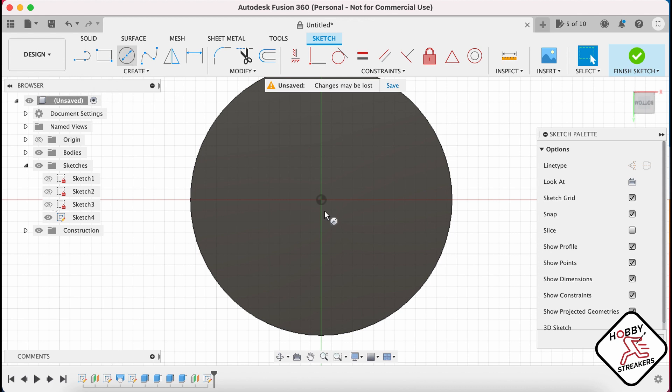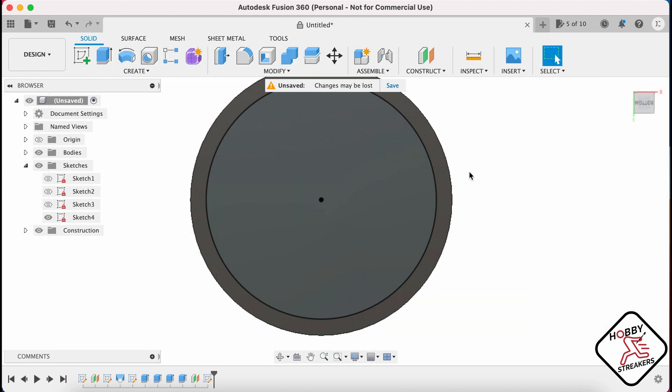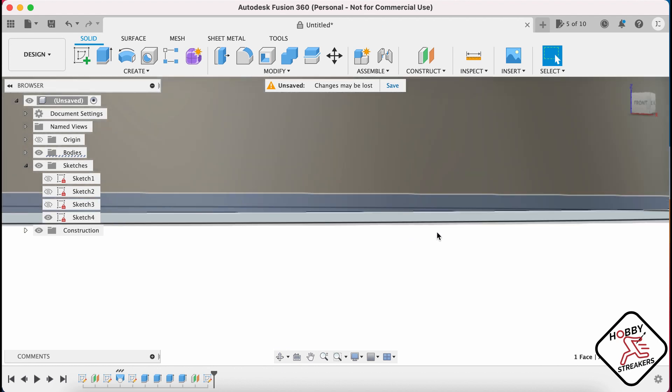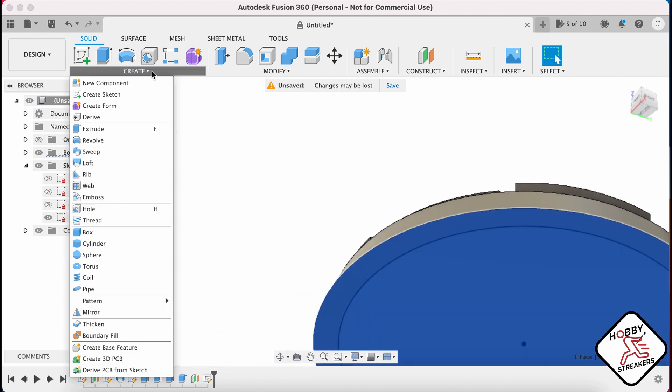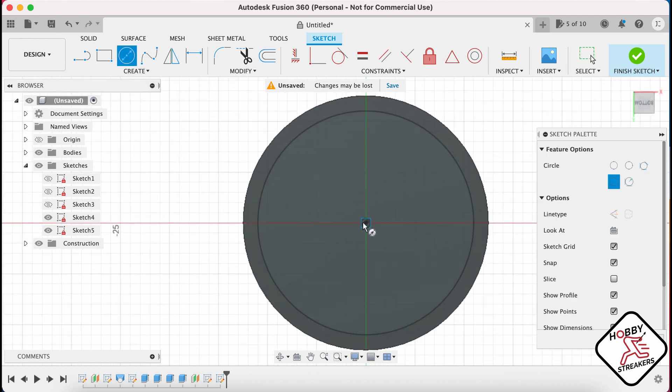This is gonna have to be a lot smaller — your circle is 25mm. What you will want to do is be at 22mm roughly for this one. And then on the actual base — this is the foot of the base. This one was a little bit further down. Now you want to create one on the foot of the base that is gonna be just one millimeter smaller — so we're looking at 24mm.